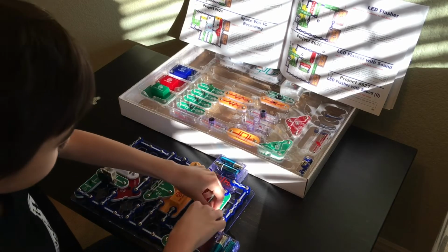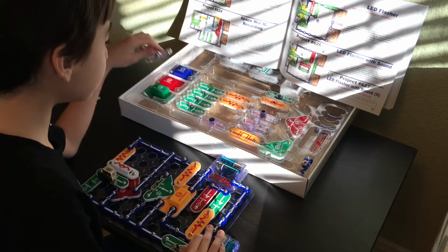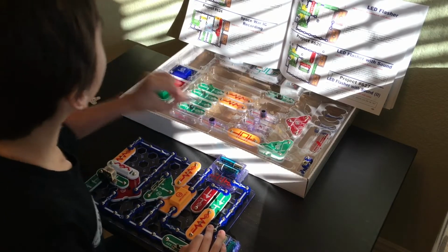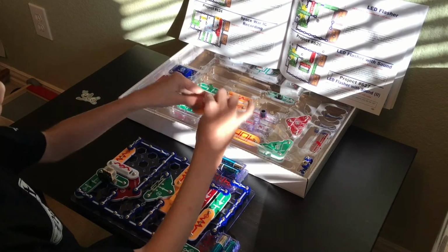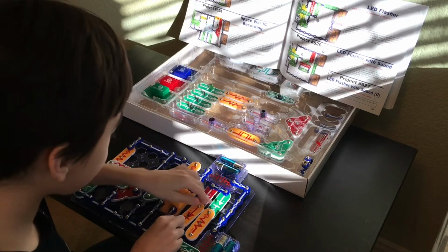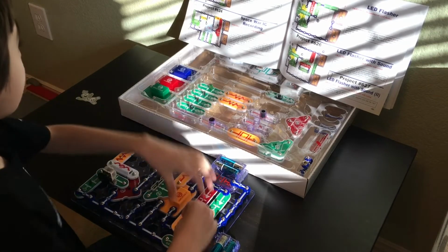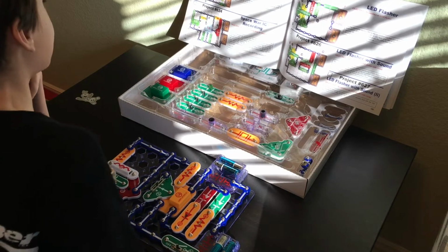So it's going to go just like this between the 3 and the D1. And then we're going to have the D3 diode. Remember, the D3 diode goes up here, and it's going to be just like this. The orientation is very important. Plus needs to be here, not like that. So I'll go between right over here. Alright, I think that finally concludes all level 2 parts.